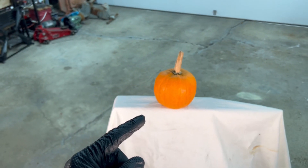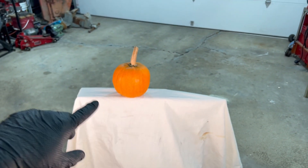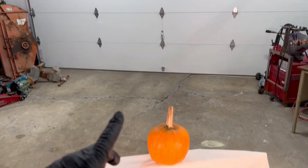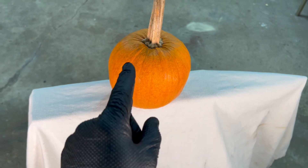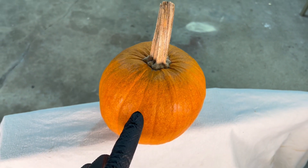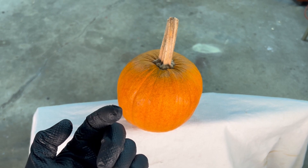I've already made other 3D scanning videos, so check them out in the link up there. Just to review, what are the important things when you're 3D scanning? Lots of light — I've got two lights down here, and lots of light up on the ceiling coming down as well. Surface texture, surface color, no sheen. You don't really want a sheen; you'd like a matte finish. And a lot of variation on the surface is ideal. A really good camera is important as well.